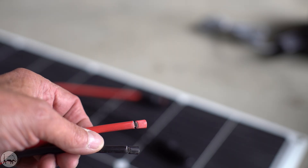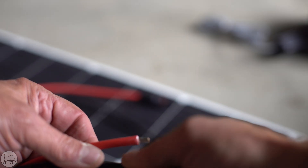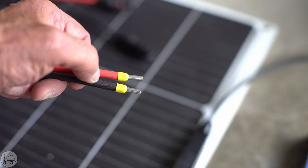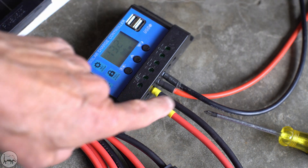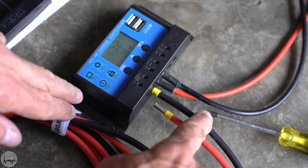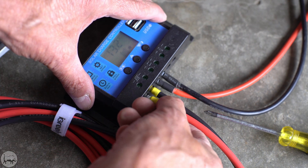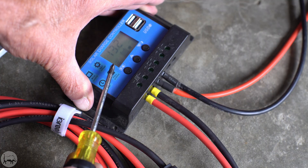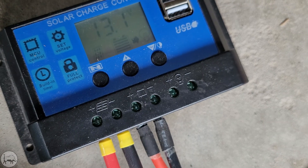This 10-foot length of solar panel extension cable I picked up off Amazon is already pre-cut. Pop these guys off and you could jam these straight into the charge controller, but I like to stick these ends on to clean them up a bit. You can also add some shrink wrap. There we go — got my little connectors on the ends of that bare wire. I've already plugged in the negative and there's that little solar panel icon. Now I'm going to stick the positive in — it just slides in — and you can see as soon as I do that it shows a little panel icon and it's sending power with a little arrow pointing to the battery.